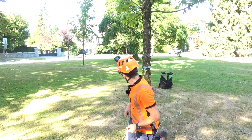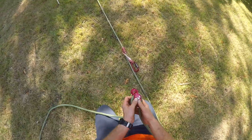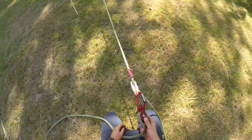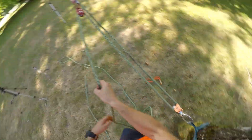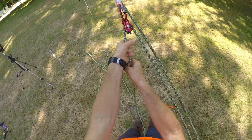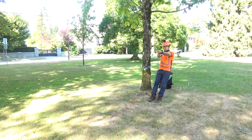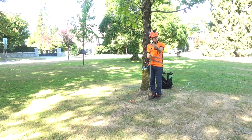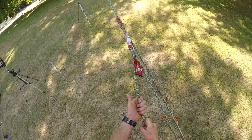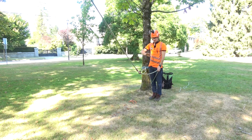Next I'll take the tail of my rope and take a second pulley, put the rope through the pulley, and attach that to the carabiner on the hitch that's on the rope. That is the basic setup. I'm going to pull the system — I've got my 3-to-1 mechanical advantage. I'll tidy the tail of the rope out of the way so I don't trip over it. That is the basic 3-to-1, but the only thing is there's nothing to stop it going slack again when you let go.